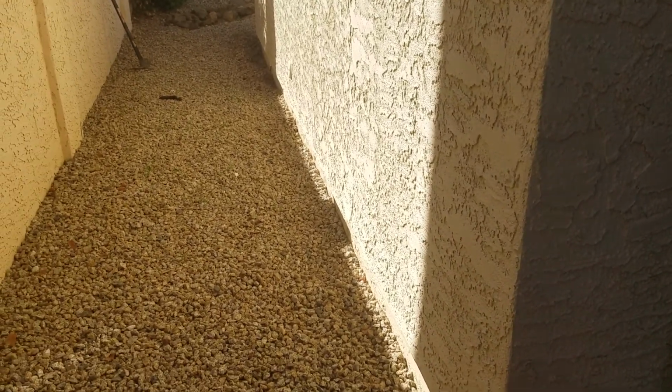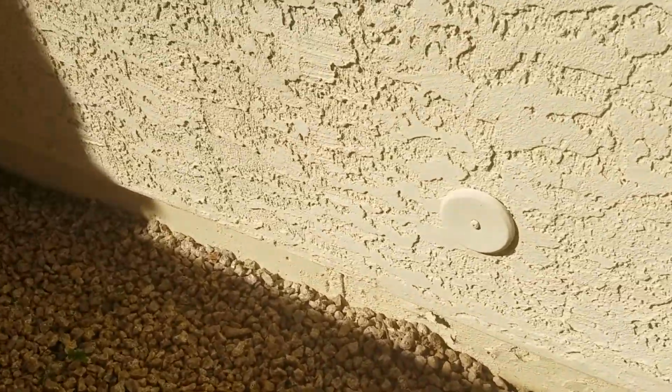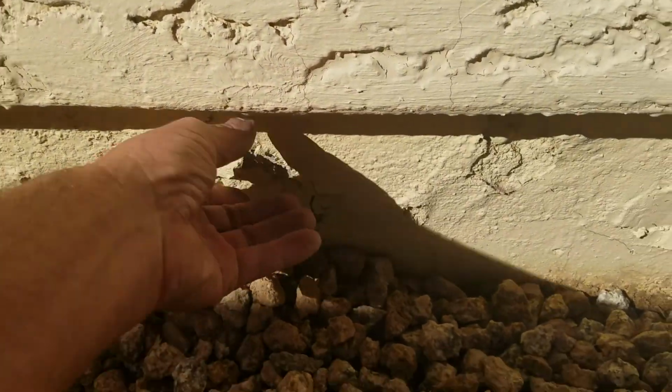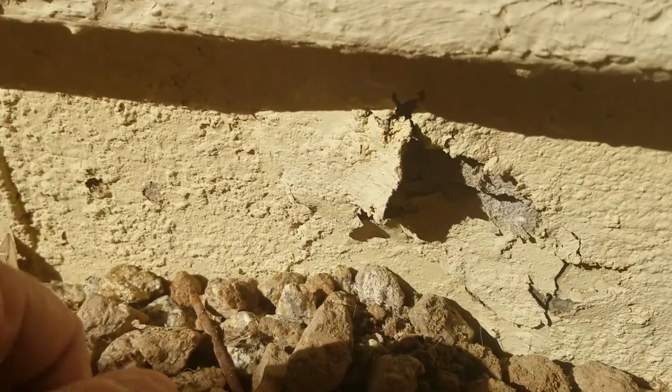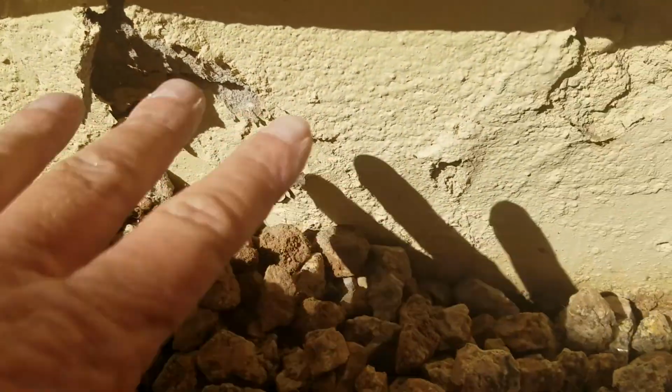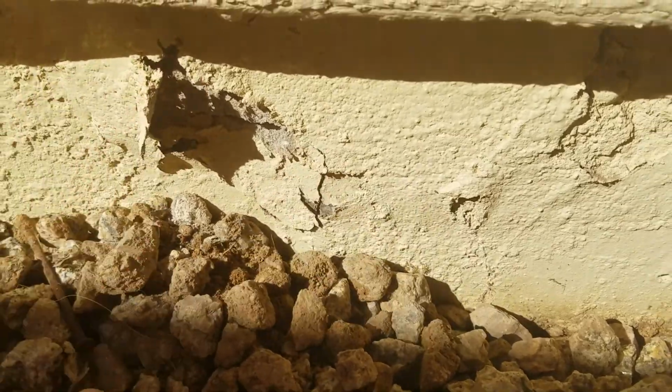So there's enough evidence to suggest 6-inch aluminum seamless rain gutters with good downspouts. And then dirt grading is another method to make improvements. That's what I would recommend as well. Over here there's a pipe on the other side of this wall. It's kind of popping out. Efflorescent salt deposit is deposited behind the paint, peeling it off, no big deal. We'll fix that just like we would like an anchor bolt.